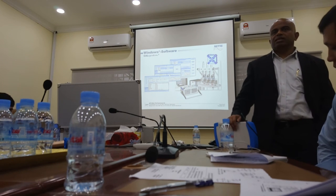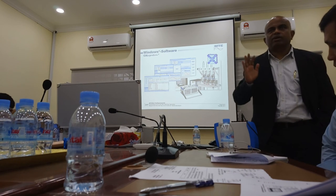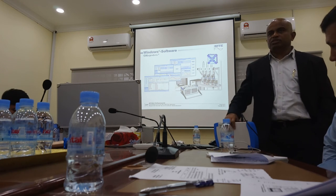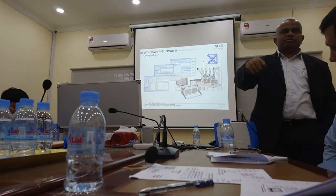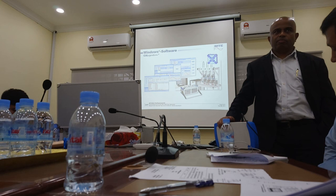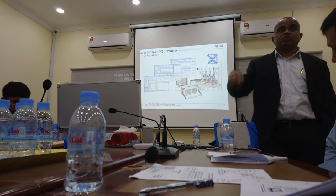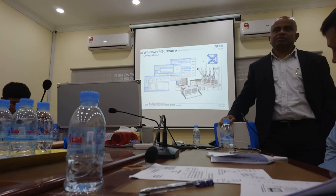You need to test it. Always remember one thing: when you test your instrument, your other instrument should be at least 5 times better, ideally 10 times. So in the province, if you need to test this, I would suggest that in EDC, I don't know where, you already have another product from us called PTS 400.3. That is a class of 0.02%. This is 0.1%. So you can always bring it back to your headquarters and test it against that periodically if you have a doubt. Of course, that instrument they have to send outside.